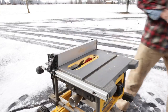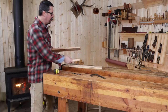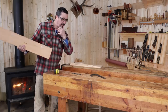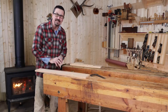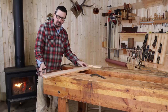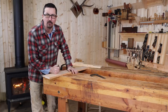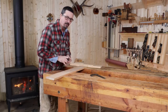That four by six piece is our third piece — I thought there were twelve pieces total, but it comes down to eleven. From the remaining board we're going to cut at 25 and a half inches, then rip those down into a whole bunch of small arms: three quarter by half by 25 and a half inches. Let me lay this out and then we'll go rip these on the saw.